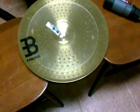Okay guys, I just got done drilling everything here. For the TC, I just laid the TC over the top, and I drilled these 2 holes for the piezo and my mounting hole. I went ahead and countersunk them. While you're countersinking, go slow, keep checking it to make sure that you've gotten enough out that the heads will actually sit flush, but don't take out so much that you're weakening the material and that you might just crack it right through when you try and tighten everything up. So you can see both the holes there.